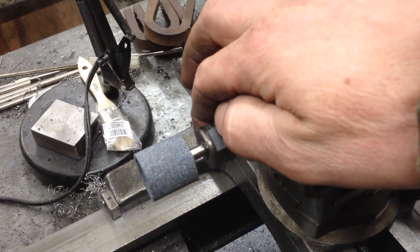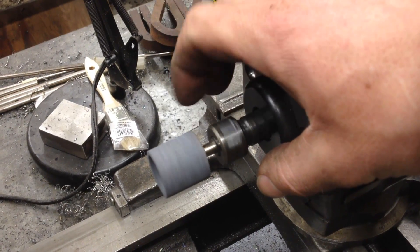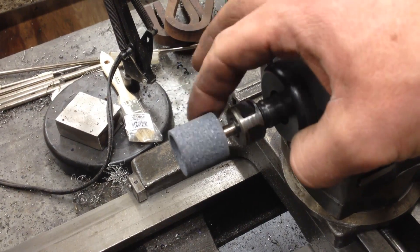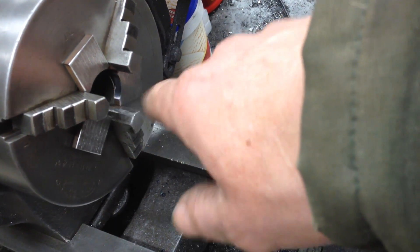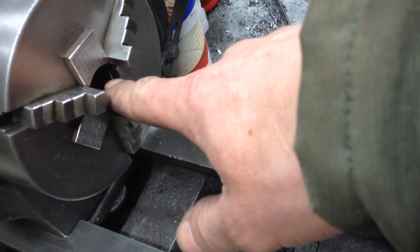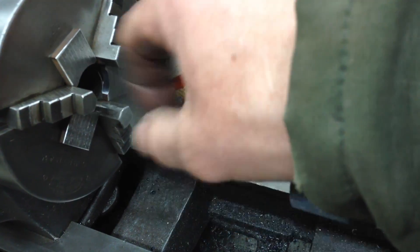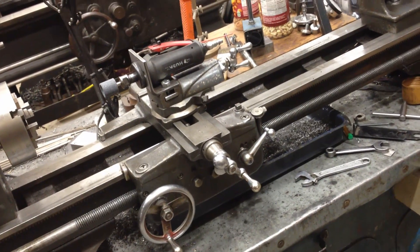I'm not very happy with this wheel — it's really out of round. I've been trying to figure out some way I could dress that but haven't come up with a good way. Since the shims are in here and hitting, it's actually going to grind that part of the metal away. I'm going to start back there and kind of pull into it, see if I can grind out those shims a little bit to dress the wheel. I'm going to put on my noise-canceling headphones because I cannot stand the noise of that die grinder — if anything goes wrong, let me know, because I won't be able to hear what's going on with the lathe.